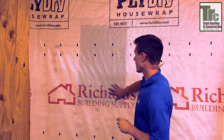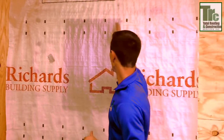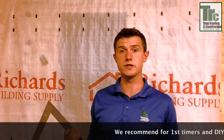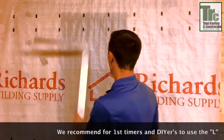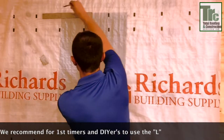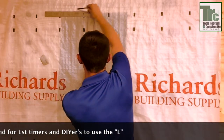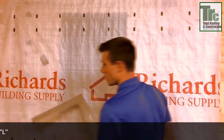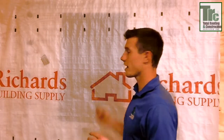So before we make our cuts, everyone has their own way of doing a flashing job. You can grab an L-square if you want to make your cuts aligned, which I recommend if you're just entering the trade or maybe you're doing the shed window in your backyard by yourself. Today we're actually going to be cutting right above — about an inch and a half down — and then we're going to just angle it.